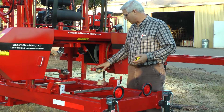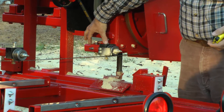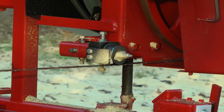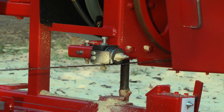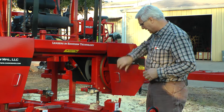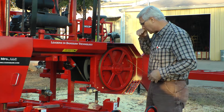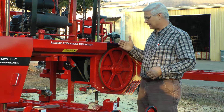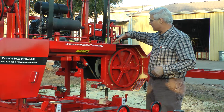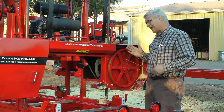This mill has the roller guides on for an inch and a quarter blade. You can see how this whole setup has a shaft that goes back into this holder and they're all adjustable. Having adjustable roller guides is very important. But the focus today is going to be on vertical alignment of the wheels. What we have found over the years is that we want our band wheels parallel with the frame that it's built off of.